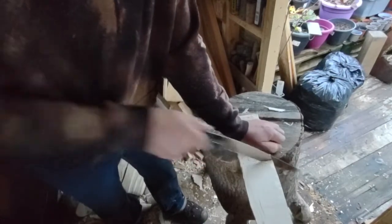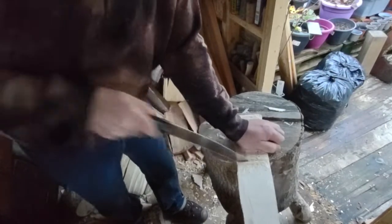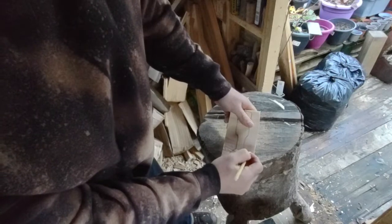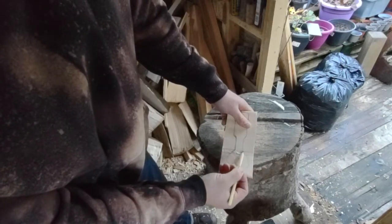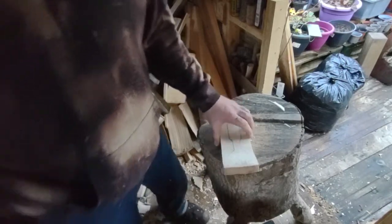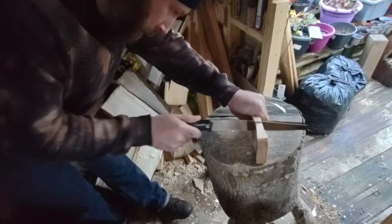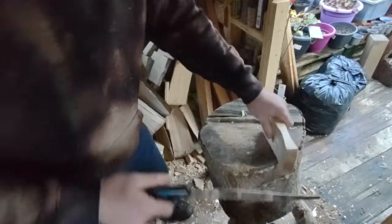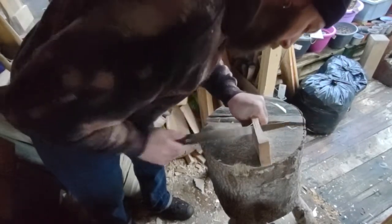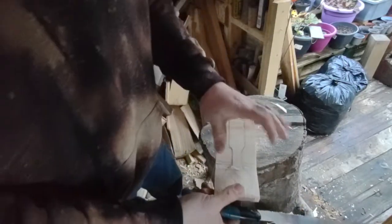It's easy enough to have that one axe strike go in the wrong place and get a severe laceration in your thumb. What I'm going to do now is cut that off there, and I've got another blank billet — cut it off across behind the handle. Next I'm going to cut in some saw stop cuts here, down across the grain towards the back of the bowl — nicely behind the bowl. You could even put in two if you want. So I'm going to cut the saw down that line but stop short of the pencil line — I'll do it on this side as well.